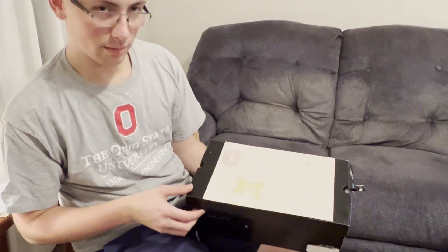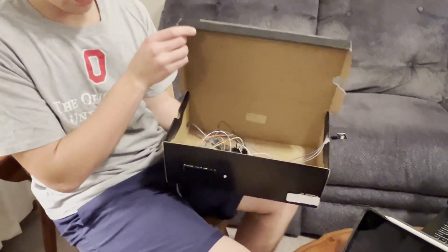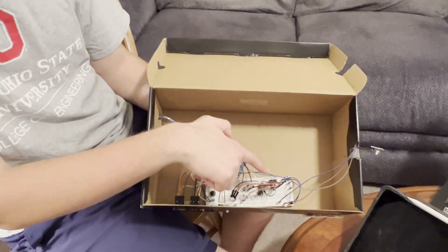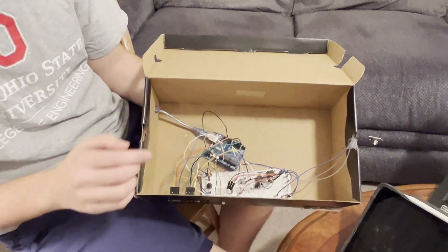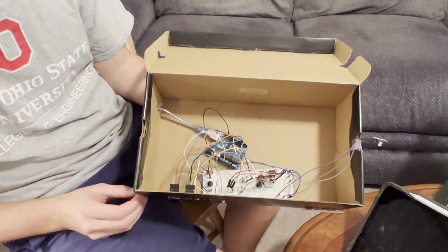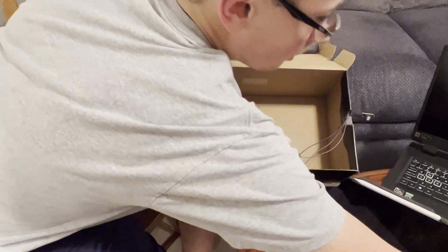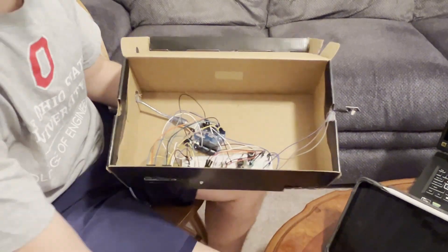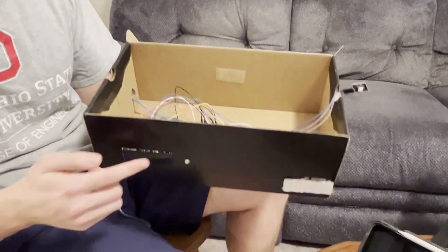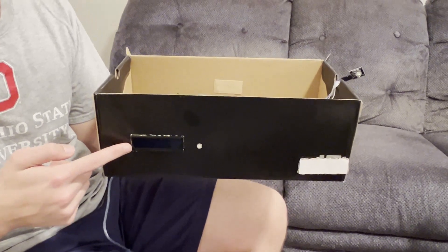I made sure it was inside a shoebox so you can get inside easily — that was one of my design requirements. Very simple components on the inside. You can see I've got a microphone here, a sound sensor that I've got using Fast Fourier Transform to analyze the audio in real time. I've got an IR sensor here that uses input from an IR remote. I've also got an RGB LED that shows the closeness to pitch if you're in tuning mode, and an LCD screen that displays your current pitch in Hertz.